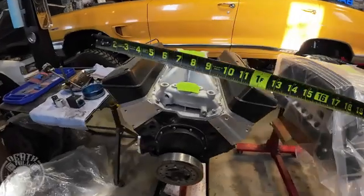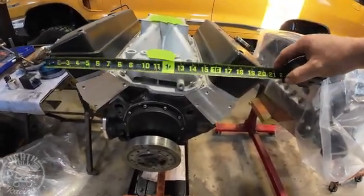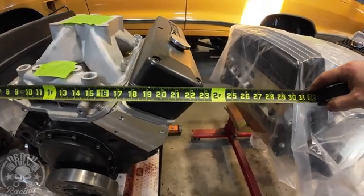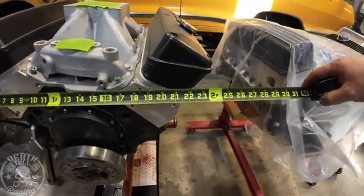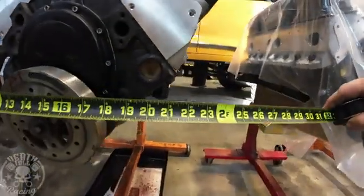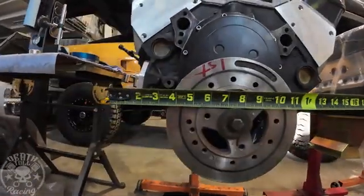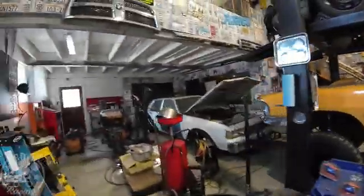Pick a victim — let's choose this one. So width: these are just sitting on there, those are actually adjustable, removable top valve covers. They're kind of clever. I've never run them — they're terribly ugly. But two feet is as wide as the engine, which I already knew that small block Chevys were less than two feet wide. So our mounts are way in there, center to center roughly 15 inches. So that should be good for a small block Chevy.